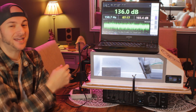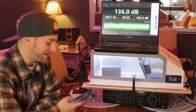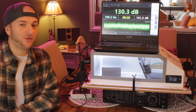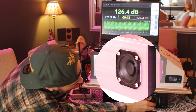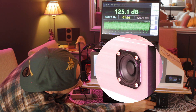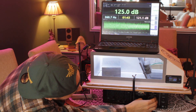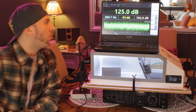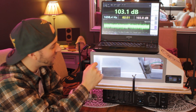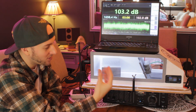With the door closed we get a 136. I can actually hear some very nasty mechanical sounds — you can hear the stretch of the spider; this is at its limits there. 15.1 watts and a 130.3. 15.7 watts and a 126.6. I overshot the power limit a little bit there — 15.01 watts and a 125, dead flat on the nose. And one last frequency just for a bit of fun — this isn't going to count towards the average — but I want to see what this does at 15 scaled hertz, which is about 90 on Audacity, because that's where the impedance sweep suggested this enclosure was tuned.